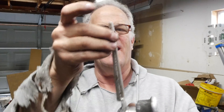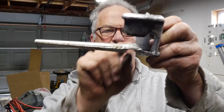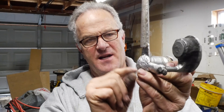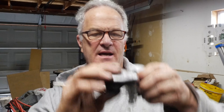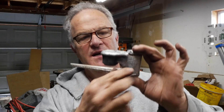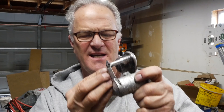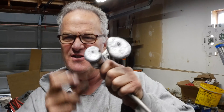I'm pretty pleased. This came out really well. Oh, aluminum is great to pour — did I mention that? I love it. The part line that I was so concerned about — that ain't terrible. I'll take that off with a file in just a few seconds. The gate I brought in is right at half the thickness. There seemed to be plenty to fill the part with no problem — went all the way up to the end. Nice basin, nice round ridge, nice narrow sprue down into the runner. Unlike bronze, no shrinkage at all. It just fills, cools off, and it's great.